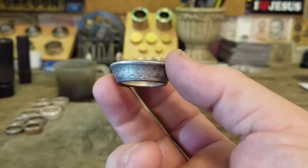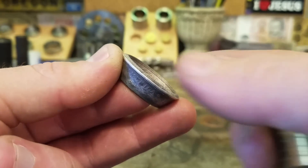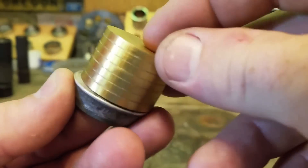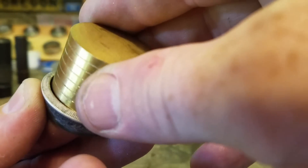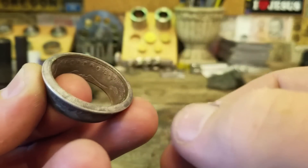So I think we have all the basics out of the way, now it's time to get started. The very first step to starting the Swedish Wrap, once you have this thing coned, is to get this reeded edge reduced in a regular die until it's just a bit larger than your first plunger. That way you make sure this has good contact on this reeded edge. If it's a little too big you have a chance of it sliding in there and really damaging your ring.